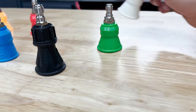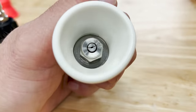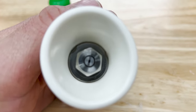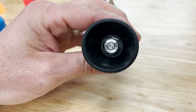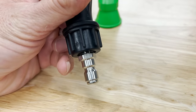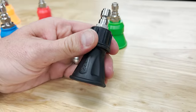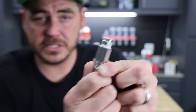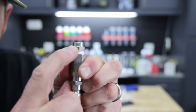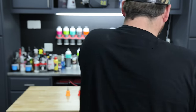When we look at the new ones from Ridge Washer, it's really nice because they actually label it right on the front cone — 40040, meaning a 40 degree nozzle with a 4.0 orifice. The McKillens is not listed on the front or on the collar sides, but if you open this up — it's very easy to do — you can back off the threaded sleeve, pull it off, and that is where they list it. It says 40040: 4.0 orifice, 40 degree nozzle.